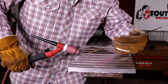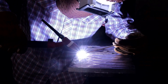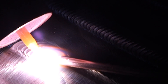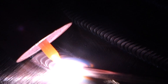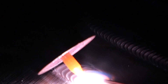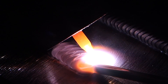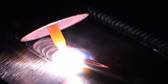Turned up 20 more — I'm at 140 amps. I'm definitely moving a lot quicker than at 120 amps. I'm not really fighting my puddle anymore to make it go side to side. But this isn't really the temperature I like running on a schedule 80 pipe — I normally like running at around 160 to 180 on my fills and capping at around 180.